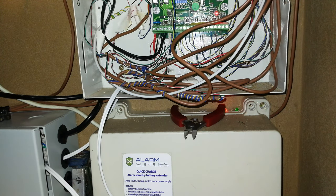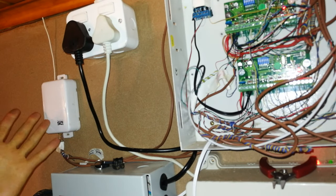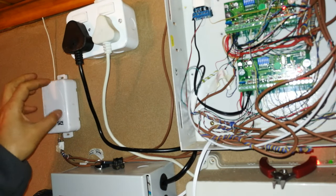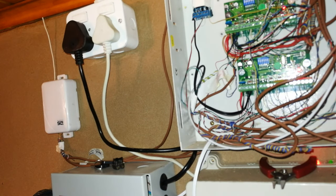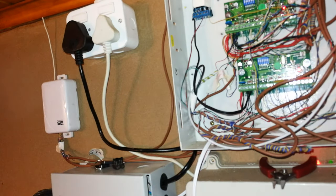All the sensors here — I've got eight zones and another eight zones. Here I have a remote receiver; they take about 40 milliamps to operate. Then I have a relay board that uses another 40 milliamps. All of these devices require power, and some of these are beams. Beams use quite a bit of current compared to your normal PIR sensors.